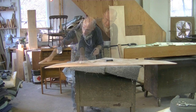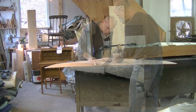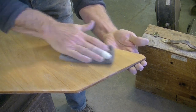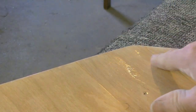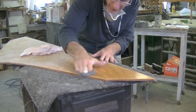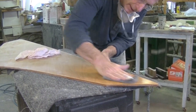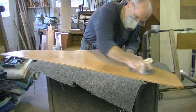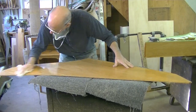So now I've got this sanded. I didn't get every single shiny spot out, because the next step — in which I'll use 4-0 steel wool — will take out those remaining shiny spots. You can see some of the shiny, grainy marks in the shellac. I'm going to take the steel wool, and I can see in my raking light that those shiny spots are disappearing. As they disappear, the surface is becoming very, very smooth and developing a really nice sheen. I do small sections at a time, making sure to get the edges really well, and I overlap with the section I've already done.